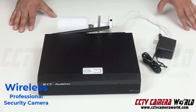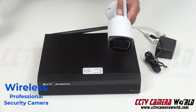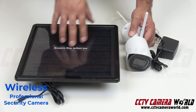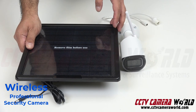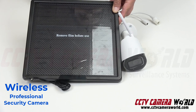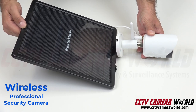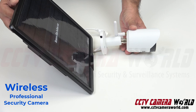Hopefully, this helps you understand how wireless cameras compare to wire-free cameras and why you should be using one. But one more thing — you can actually make these wireless cameras wire-free. There are solar panels now that you can use, originally for trail cameras, but you can also use them with wireless security cameras to make them wire-free. This particular one I found has a 12-volt output. Once you charge it up and connect it to the camera, mount the camera — and there you go — a wire-free professional security camera. There are mounting options on the back of these panels, and we'll put a link to them.